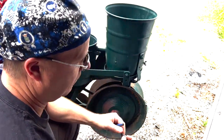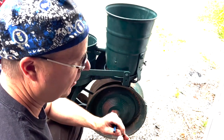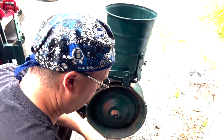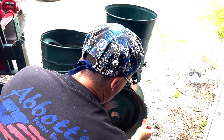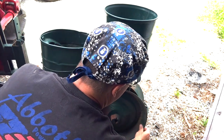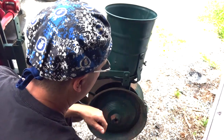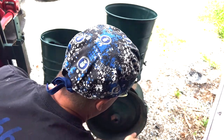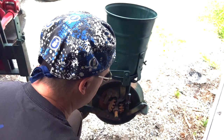The newer ones have a snap ring or one of those hitch pins, hitch clips. This old one has a roll pin on it, so it makes it a little bit more difficult but it's not undoable. So we're going to take this wheel off — there's two of these press wheels. Be real careful when you spin this because this cleaner right here will get your fingers, as well as this clamp and bolt. So be super careful when putting it on and off to not get your fingers stuck in there.